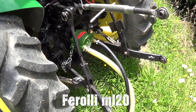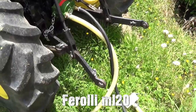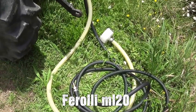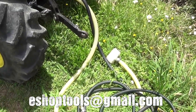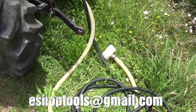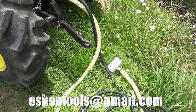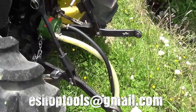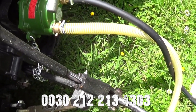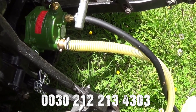This is a self-priming roller pump. It comes with 7m of wash down hose with a brass jet on it, 3m of pick up hose with a suction screen filter, and all the fittings are included. It's a good idea to make sure that the hose clips are done up real tight, because being self-priming it needs a good seal to make sure it's not going to suck any air.